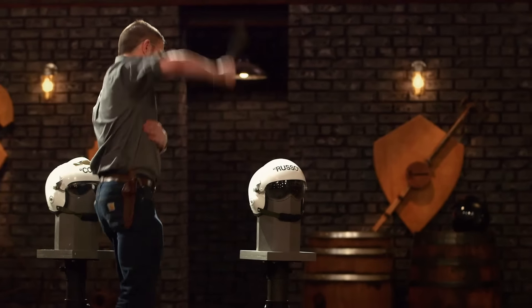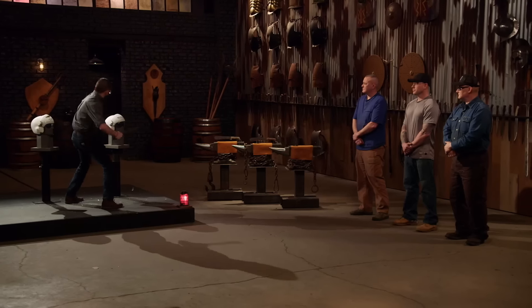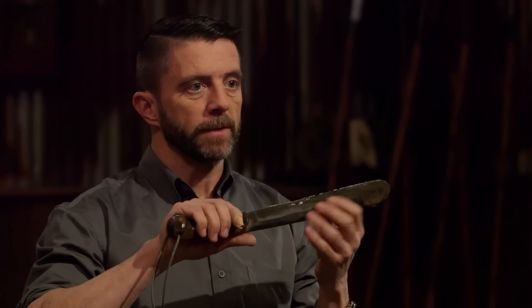Joe, you're up. How are you feeling? As ready as I can be. Joe, your blade here suffered chipping — there's a big dime-radius chip, and then the rest of it is chipped as well. I think that when you were chasing this delamination, you ended up with an edge that's on the thinner side. Aside from your blade, the handle is a good size, good dimension, and I like the contouring. But there's just no denying this chipping on the edge.